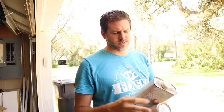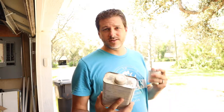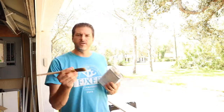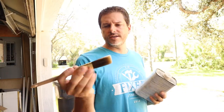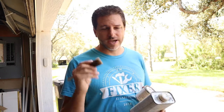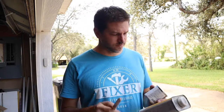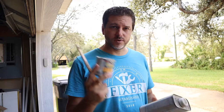The biggest thing with these products is that they're oil-based. So if you're doing any of this, make sure you've got mineral spirits. If you're using a brush, you're going to get stain all over it — and this goes for oil-based paints as well. There is no way you will ever clean a brush with just water if it's oil-based. You have to have mineral spirits. So if you've ever struggled to clean out a paintbrush and can't figure out why it's not getting clean, it might be because you're using oil-based paints.